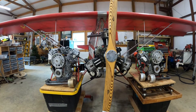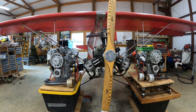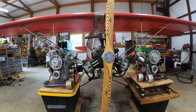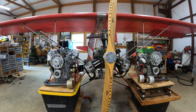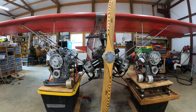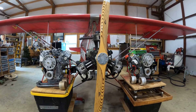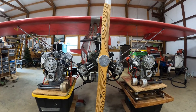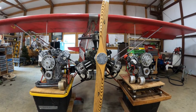The base engine, with the flywheel and intake manifolds removed, with the starter and everything else removed — the small engine is 51 pounds, the big engine is 81 pounds, and everything is bigger and heavier on that big engine. It gives you the power and does everything you'd want it to do, but it also gives you weight. On this particular airplane in this configuration, I had to add 8 pounds of weight to the tail to bring things back into a CG level that was comfortable.